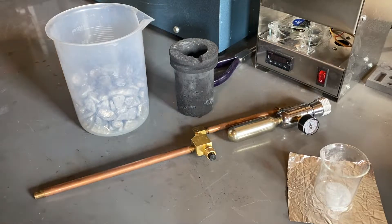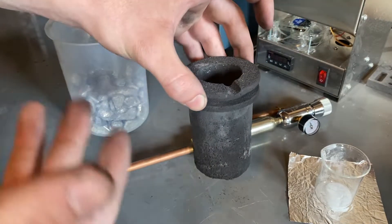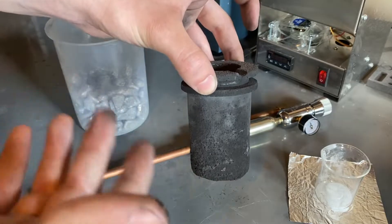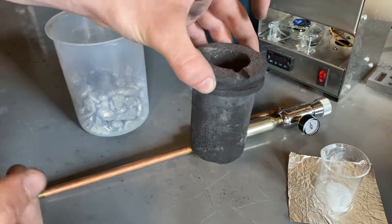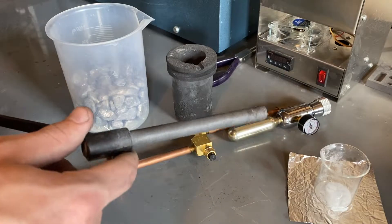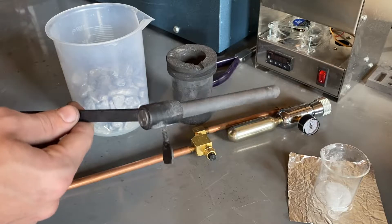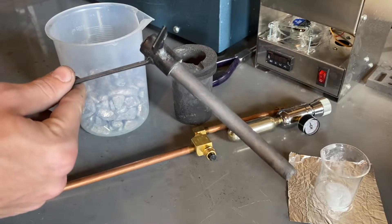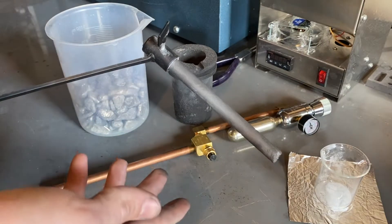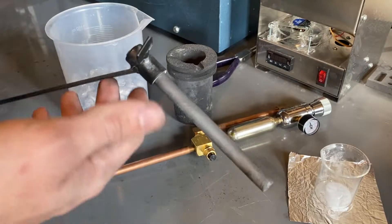The water could be introduced from a number of sources, but it's most likely from our graphite crucible. It's quite humid here in Chicago, so this graphite crucible could have some moisture condensed onto it or absorbed into it. We also use things like graphite stir rods to check the molten state of the metal and to stir in fluxes, and these are also made of graphite.